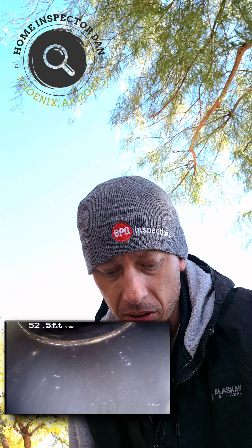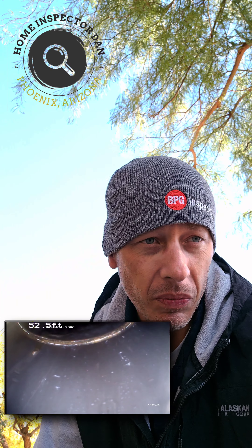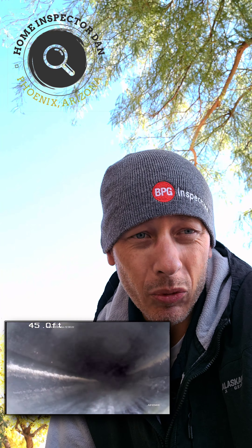There's the bathtub entrance into the plumbing system drain line, and that's probably going to be the end of the line. Now we go straight up — this is going to go up to the roof; that's your vent stack that allows air to travel back through the lines so you're not gurgling and bubbling your toilets every time you flush or run water down the drain. ABS pipes look good. We're going to pull this back slowly and look at the same stuff on the way back — check for breaks in line, excess sludge, anything that might cause a clog. There's a little bit of debris in this section on the top of the pipe but nothing to be concerned about.